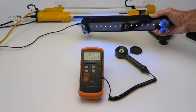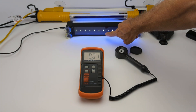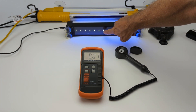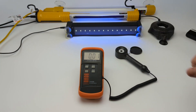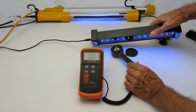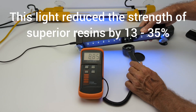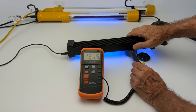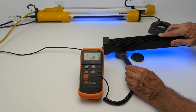Now take a look at the bulbs — you can see they are three-quarters of an inch apart, and right there it tells you that you're going to have a hot spot where it zaps real quickly at the bulb. Between the bulbs it's going to pull in on the center — that's exactly how you get tension in glass. This will put tension between the bulbs, and each bulb gives off a different amount of energy: this one is giving off 19, this one 18, this one 18, and this one is at 11.